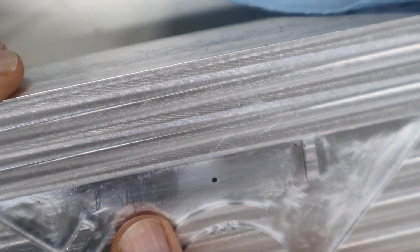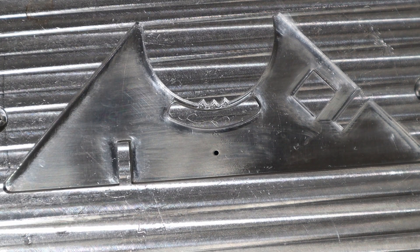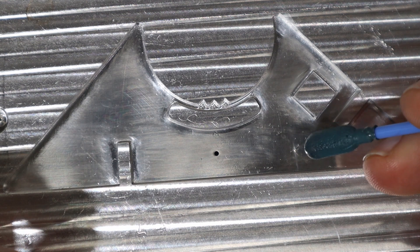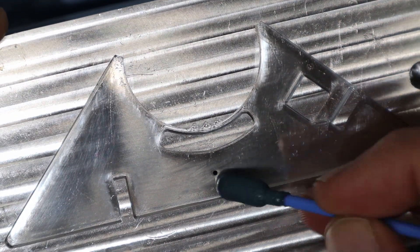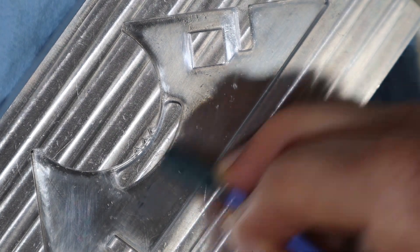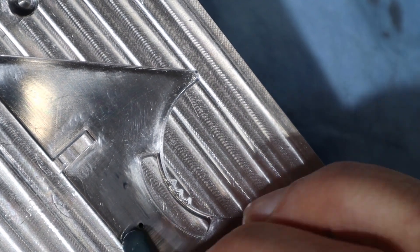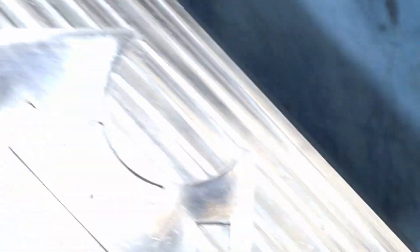I think I might be pressing too hard. I made some more progress using the same diamond-coated sticks, but I changed the tactic — I'm using much lighter strokes. What I started doing is going in very small step-overs fairly light in one direction, and then after doing that, going in the other direction also fairly light. The idea, as described in the other videos, is that going back and forth like this will result in it becoming smoother and smoother.